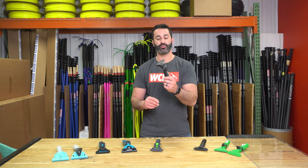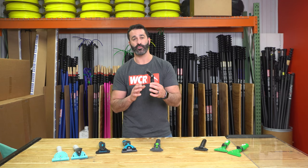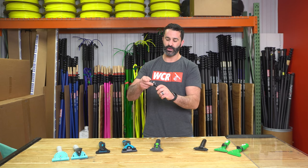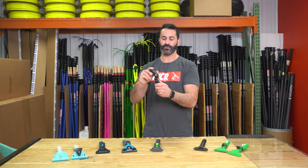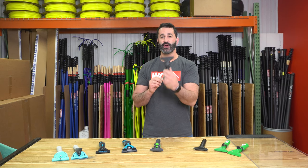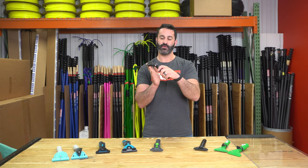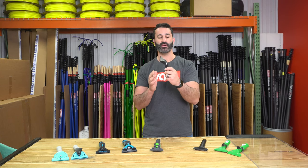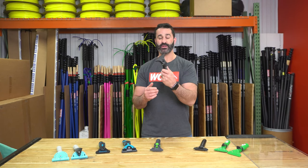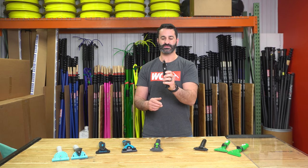They've also got the Contour Pro Plus. This will hold standard channels, standard clip channels, or there is a version for the super channel. The Contour Pro Plus will pivot back and forth — again, it is a little bit tight but you can loosen it from the back. The other key feature of the Contour Pro Plus is that it is spring-loaded. This makes it really nice for closing out windows — when you come to the edge of that window, it will give a little bit, really a nice cushion feel. You can also lock this handle into a zero degree.